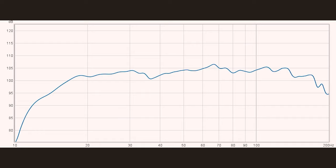As you can see with the REW graph, this is an absolutely beautiful measurement. It falls off really nicely at about 18 Hz. There's a small room null at about 34 Hz, and that has been a consistent room null in my measurements, so that has nothing to do with the speaker. It has a bit of punch around 66–67 Hz, which is nice, and a gradual fall-off at about 120 to 130 Hz. Overall, this is a really good looking REW and SVS should be very proud of the engineering on the SB2000 Pro. So since science gives it the two thumbs up, let's go listen to it.